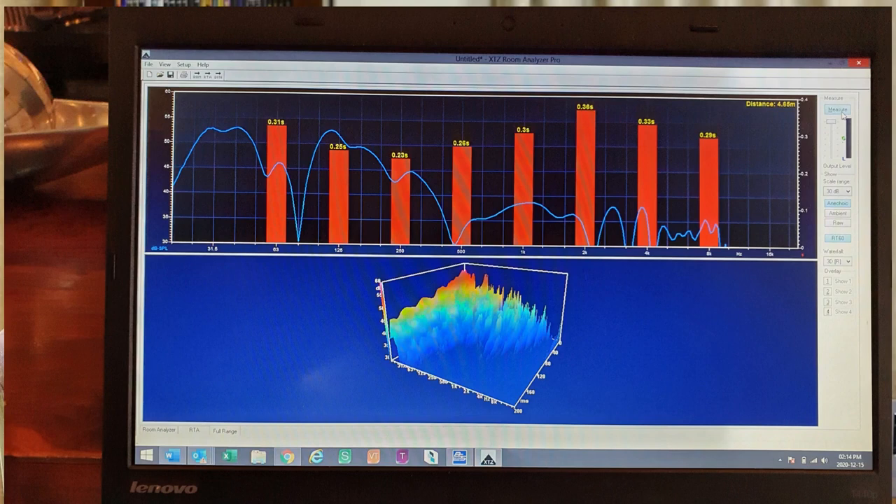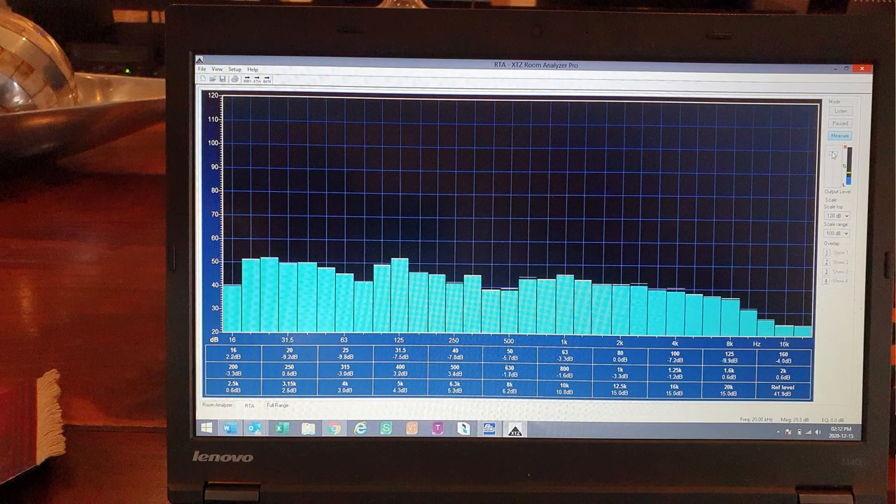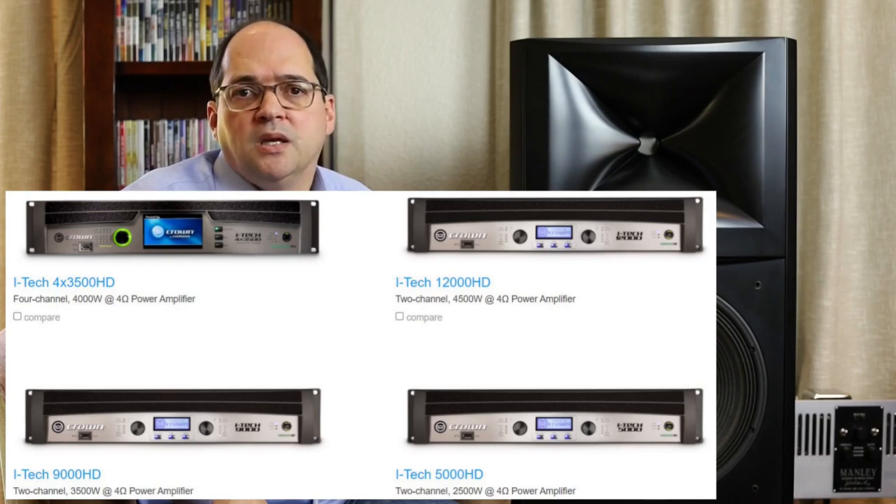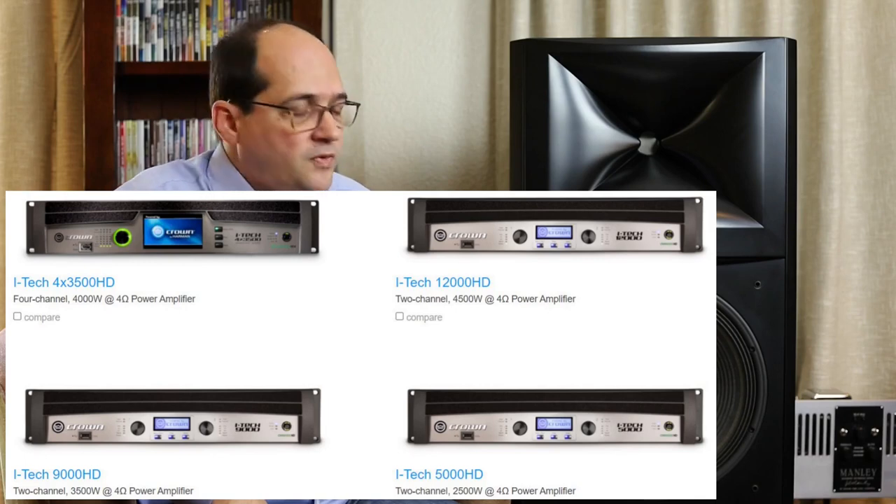HFX came out to my room the day we installed the loudspeakers and they used room calibration software together with the BSS — we were able to calibrate the sound as an initial phase very well, and the out-of-box performance was actually quite good. Another configuration option is to use the Crown i-Tech and Macro-Tech amplifiers with their built-in DSP capabilities. A four-channel amplifier can use the internal DSP together with the JBL configuration file to tweak the loudspeaker for optimal performance.